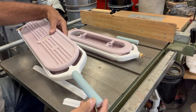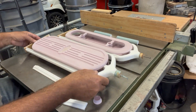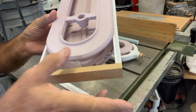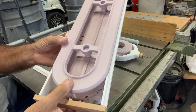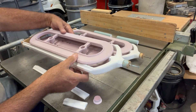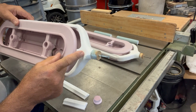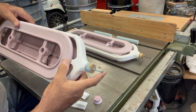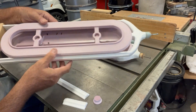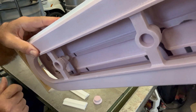I add the sprue stock after I dip them because they're kind of fragile with them on there. I just glue those on right before I get ready to cast them. I did put in one little brace support here - you see where my finger is? That just supports the patterns, keeps them nice and flat. When I glued them together, I weighted them on this flat surface, so that bow I was talking about in the previous discussion - that's gone now. They're flat and they're pretty stiff. Even though it looks like it's another feed to the pattern, which it is, it's really there to make it sturdier so when I dip them it has more strength and is less likely to break. And if you look inside here, you can see I actually attached them in the center - there's a little boss there at the end of my finger that actually connects the two sides together.